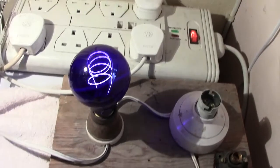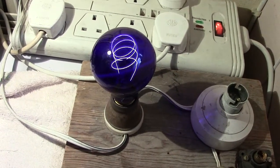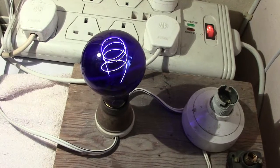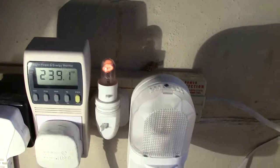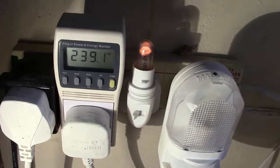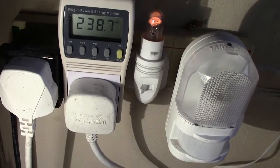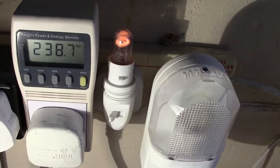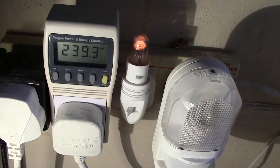Now the reason I say this, we got a projector lamp the other day through the post. It was one that Alec ordered, but one part of the etch has been rubbed away, and you could see the voltage but not the actual wattage. So you could in fact use this little device, which I'm not going to, the bulb's not mine, it belongs to Alec, but you could in theory light the bulb up on the full voltage, which I believe was 240, and that would give an indication of what the wattage was or is. We both think it might be 500, but we'll have to wait and see.